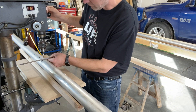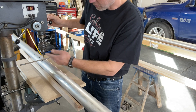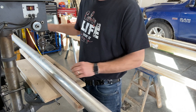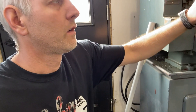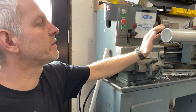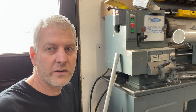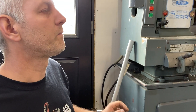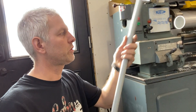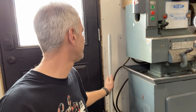Put this on. If you apply just a little bit of pressure, if you're off a little bit, it'll either go one way or the other. This one's sitting right on. Now before we start to drill, I found the center of the tube, I got it sitting in here centered, the drill bit's in the center. Now we gotta make sure that I-beam is dead in the center. To do that, if you look down at the end of it, you can kind of line it up with your drill bit. And if you gotta move it, you just take that plastic pipe and put a little groove in it — you can get in there and turn it pretty easy. Now we're lined up and we are ready to drill.